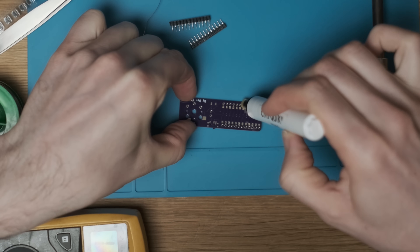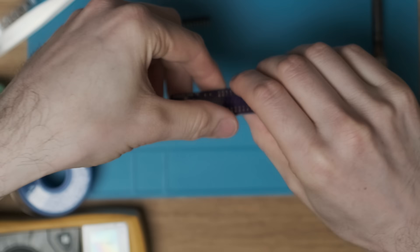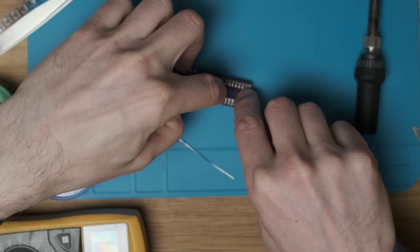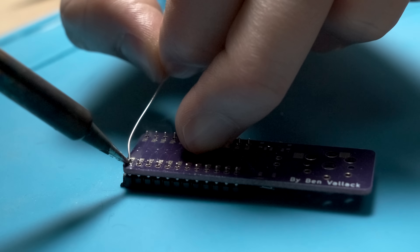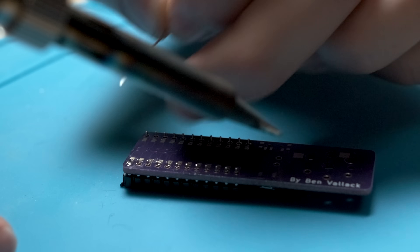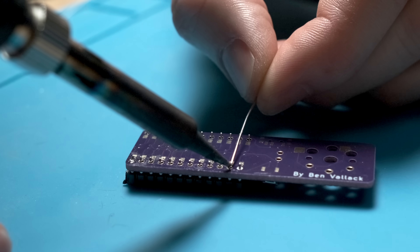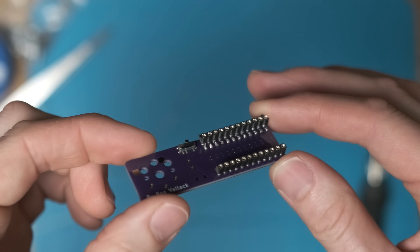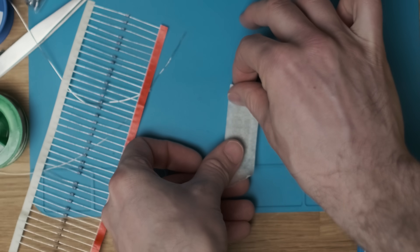Now I'm adding some flux to the back over the through holes in preparation for putting the sockets in. We drop the sockets into place — it's much easier to have both of them in at once for stability. There's still a bit of play so you have to hold them as upright as you can, then get one pin soldered in to add stability and make the rest easier. You heat up the edge of the through hole and the pin at the same time so they're both hot, and then you'll see the solder flow down into the gap. This is definitely not a soldering tutorial — I'm no expert — but it's about showing you how approachable it actually is with basically no soldering experience.